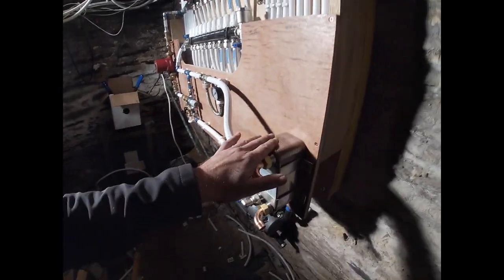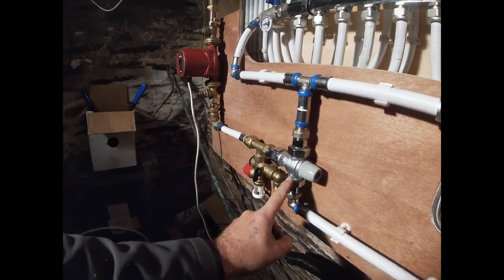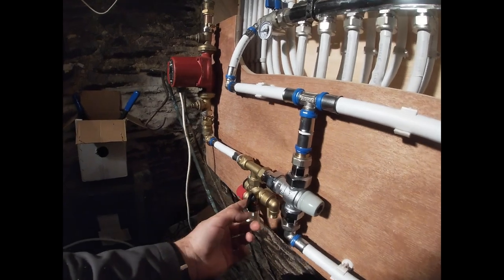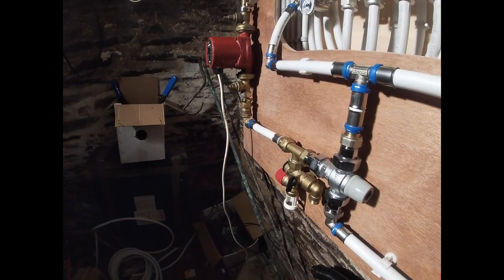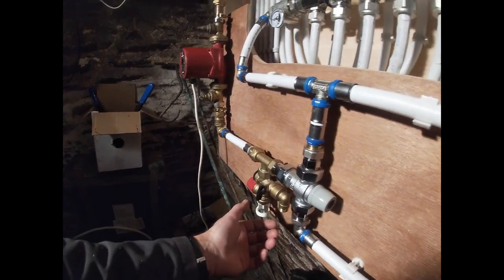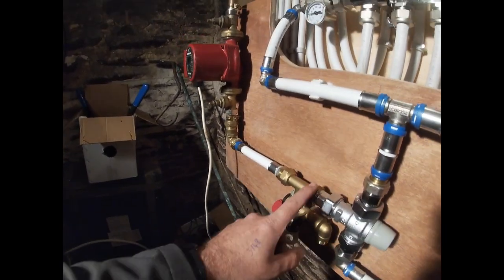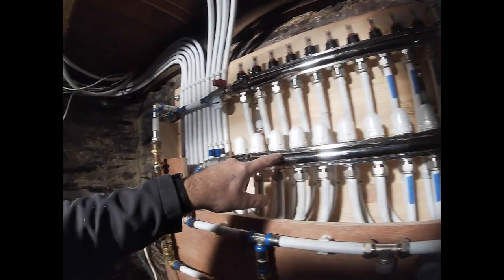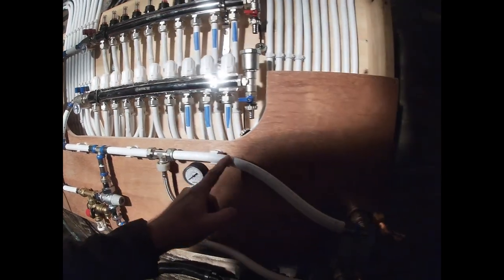The flow out from the heat exchanger goes into the thermostatic mixing valve, which mixes with the return water to give whatever temperature we want by regulating the valve. There's also the filling loop and safety valve — if it gets too hot or pressure builds too high, water drops out at the bottom; that's also where I add cold water to fill the system. It then continues at the desired temperature through the pump and out to each individual radiator, returning here, where it either gets remixed with hot water or returns to the heat exchanger.